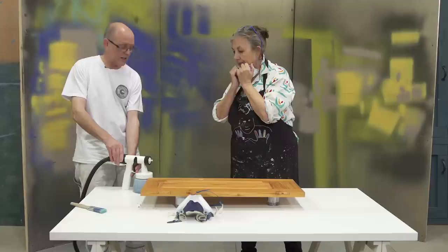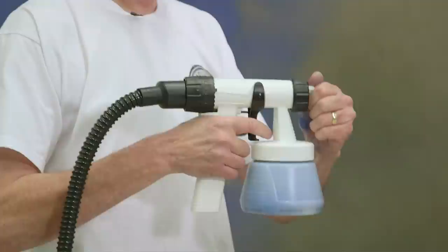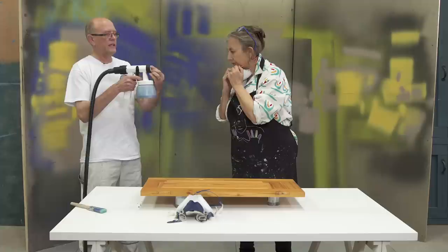There's basically a cam in there — it's a simple adjustment. As you release the trigger, the cam goes further away. That's all you need adjustment-wise. You do need to remember that if we are going to spray vertically, the horns of the gun need to be in line with the way you're spraying — so if you're going down, they need to be like that. If we're going horizontally, the horns need to be like that. If you go the wrong way and set to vertical when going horizontal, you'll get a big build-up of paint on the surface.